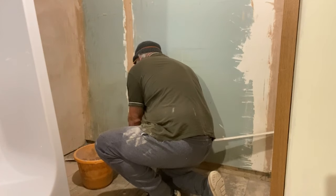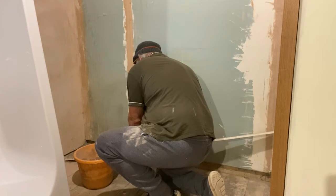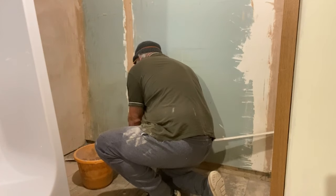Right, I've got this wall up to some fashion — it's not screwed in properly but this is going to tell me where my bath slides in. The problem is I can't plaster this wall because I've got no room, so I'm going to plaster it and then move this wall back two or three mil once it's been plastered. I can only go up to the middle because I can't plaster the ceiling until this wall's in, and I can't put this wall in until I've done all my electrics. My next job is to clear all this out and address this wall.